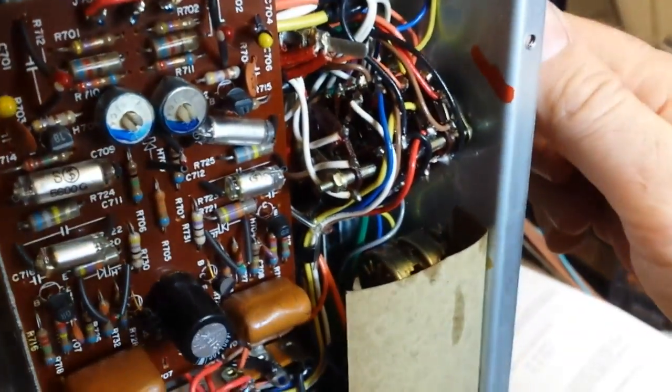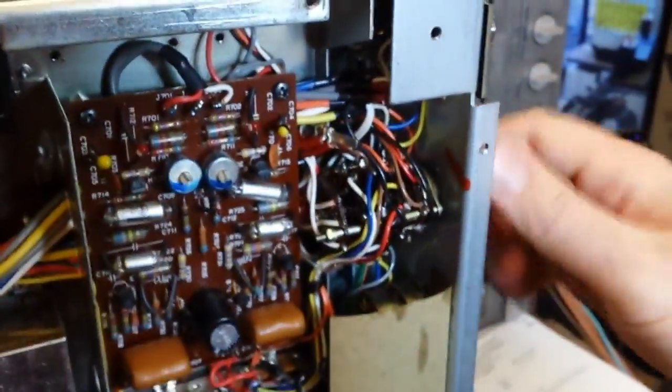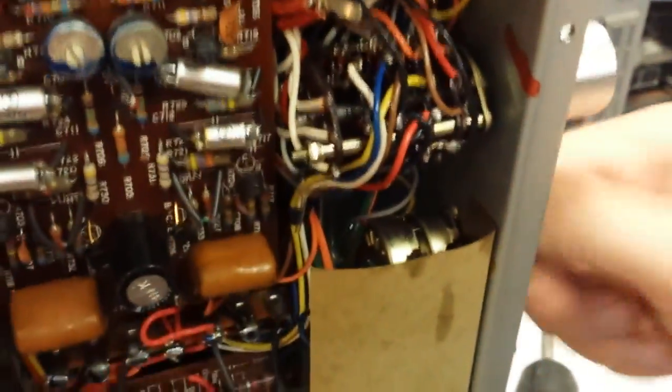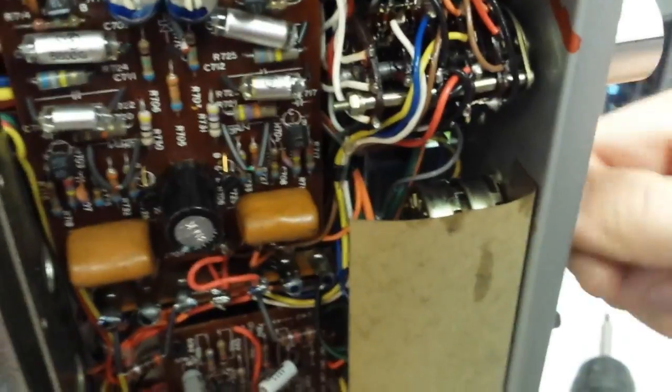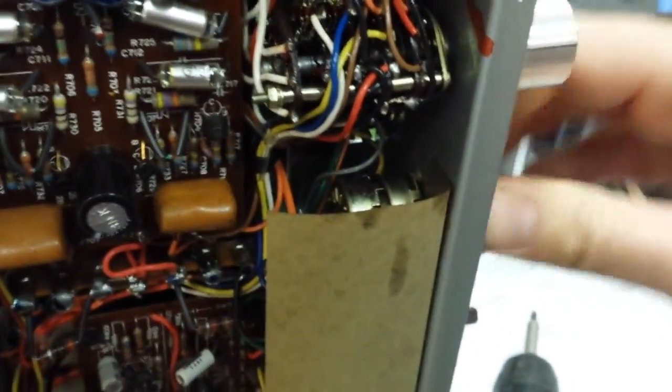Notice how when I turn that, the whole switch jiggles? Well, that's the case with any of your pots or switches. Come over here and tighten these nuts. Don't let them be loose — you'll get little intermittent ground connections that will cause crackling and static when you change inputs. Then we'll just do the bass control here. Turn it about 20 or 30 times, preferably more. This is going to make your wrist hurt, so if you have arthritis, beware!